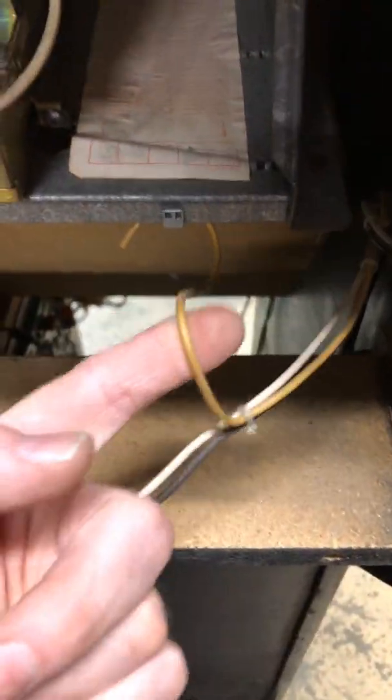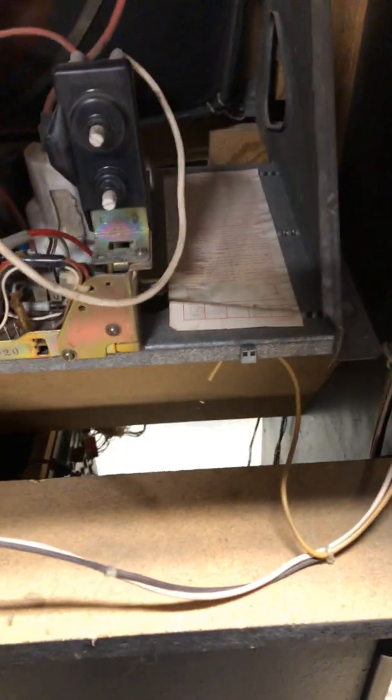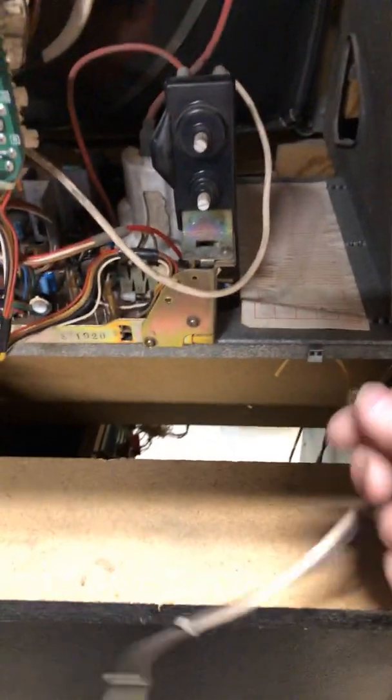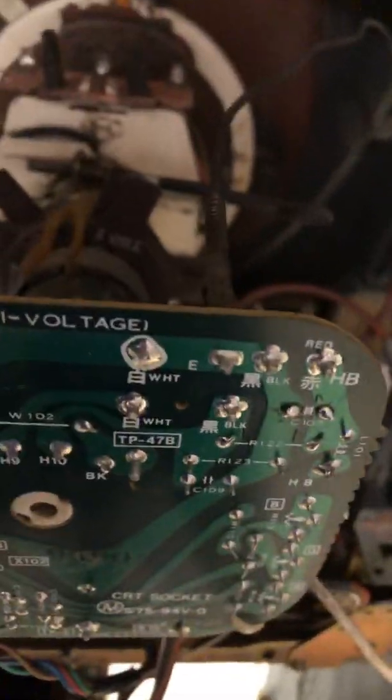It's not pretty if you plug it in and damage something or you don't have an ISO. If the monitor's got earth ground on it and you've got an earth ground pin on your socket on the end of the cord, you're probably going to be okay. If that isn't there or the pin's not there, then the frame of the monitor becomes about half wall voltage — so 60 or so volts. And then the ground pin on your signal connector sends that 60 volts AC back to the logic board, which obviously isn't good.